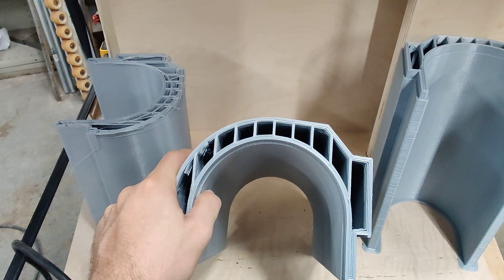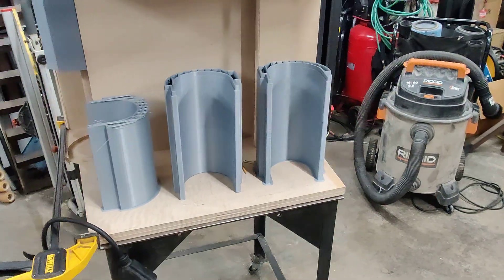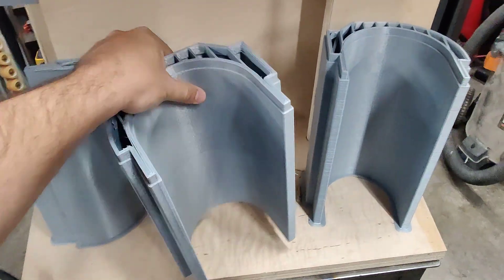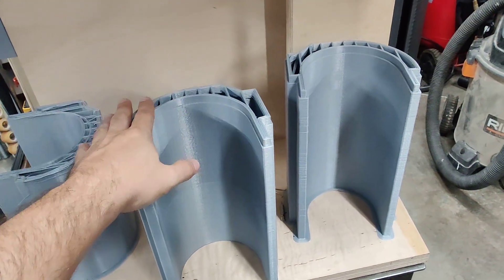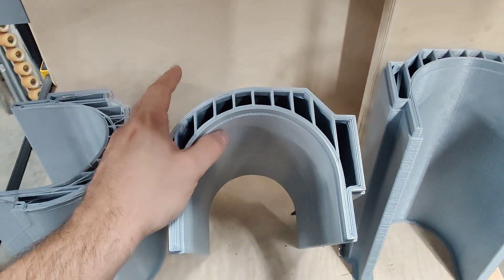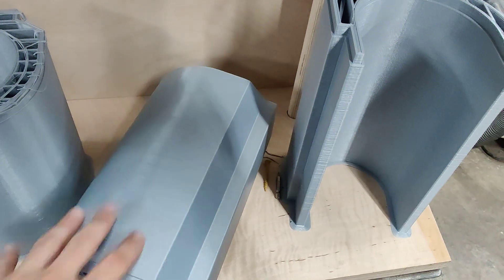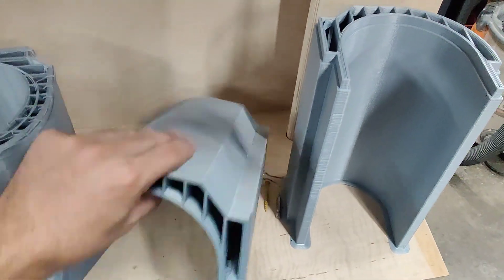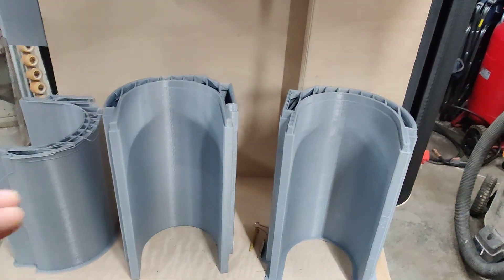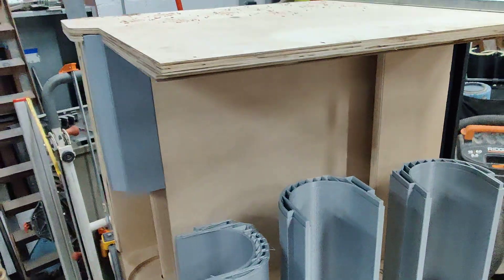It's also going to get a coating on the outside of the print, which is going to give us a reinforced, really strong print. If we wanted to go all the way, I would electroplate it in metal — that would make it especially strong. If we left it hollow on both ends and plated it, this would be a ridiculously strong piece. The channels through the part would be plated inside and out, permeating through the layer lines.